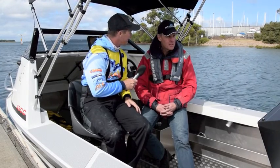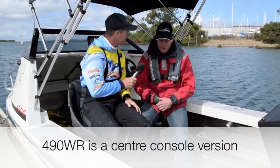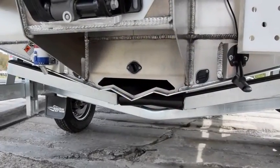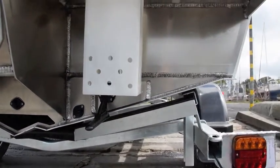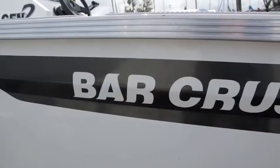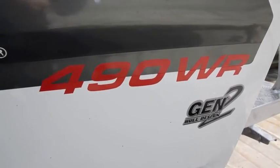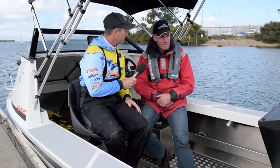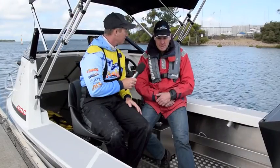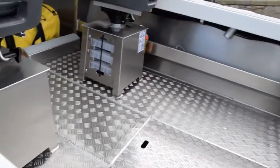The 490C and 490WR are both the same hull — a new Gen 2 hull design with a delta flare planing plank underneath. They share the water ballast feature, the durable rigid deck subfloor engineered for strength and durability, and are all high tensile 5083 aluminium — true plate boats. The 490WR is designed for people who want to fish impoundments, estuaries, and rivers — flicking plastics or fly fishing — but it's also proving to be a great little coastal boat. The cuddy cabin model is designed for bays, estuaries, and coastal work, with more protection popular with families.